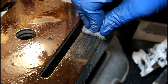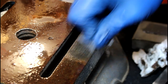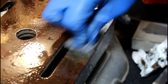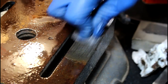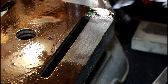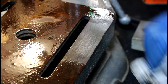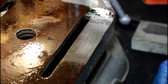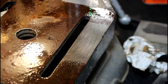Depending on how smooth it was from the factory, you'll get a pretty nice finish. My old Delta 17-inch drill press worked really well because it had a nice smooth ground finish. But some of these older less expensive drill presses were just milled and left with a rougher finish. You could take a wire wheel to this, but I'm not a fan — doing it this way, if you're careful, all your milling marks stay on there and you're just taking off the rust. Some wire wheels can be kind of aggressive. I like these machine marks — I think it's kind of part of the drill press.